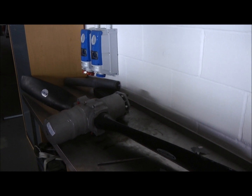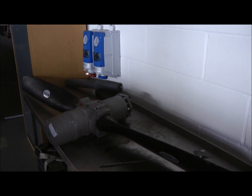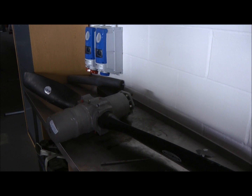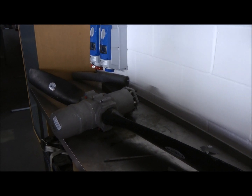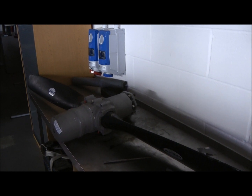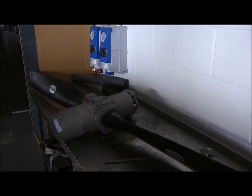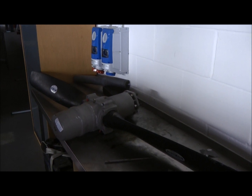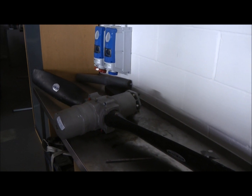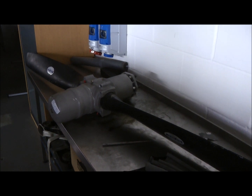So on takeoff you might have the pitch quite fine to increase the revs, increase the horsepower, but once you get up to altitude and start cruising, you'd want the blades to go more coarse so that you'll be able to get a similar amount of thrust without very high engine revs. That will save on engine wear and tear, but it'll also save on fuel while you're up there.